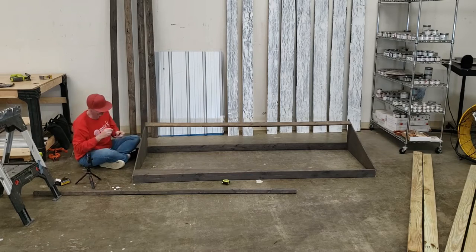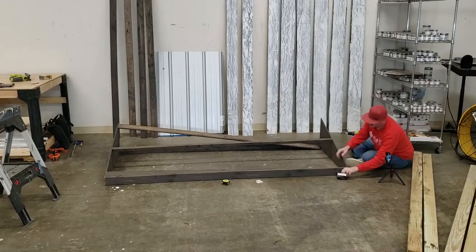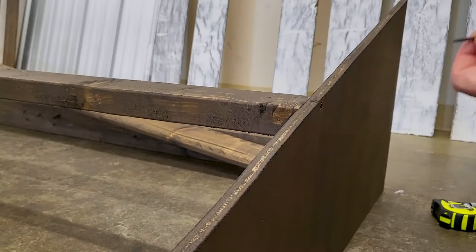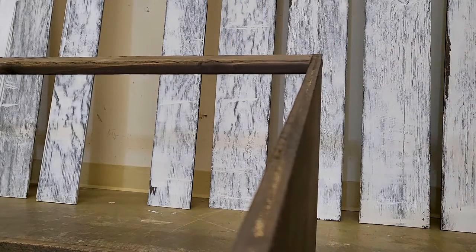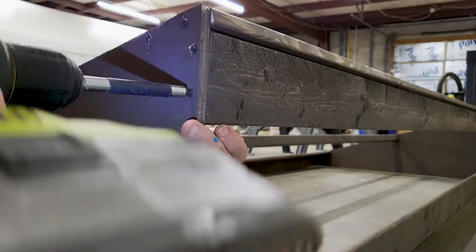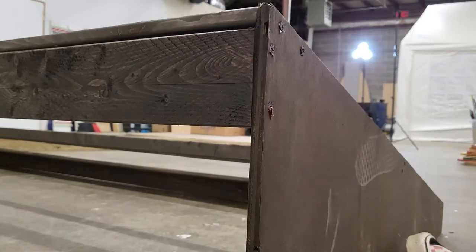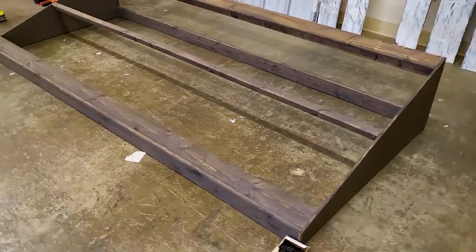I measured halfway down the incline and marked it — that's where I put the two-by-two, using two drywall screws so it won't turn, keeping it flush. I did the same on both sides. Then I added a brace in the upper back part for a little more stability, using one of those furring strips attached on both sides flush with the back. This board was really warped so I had to give the old reach around. And this is what it looks like all ribbed out — I built it like I was building a ramp.